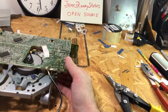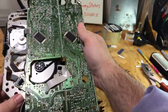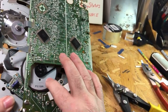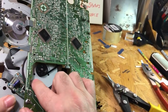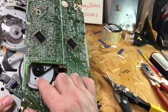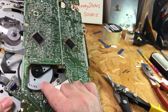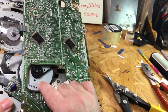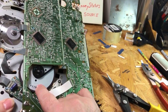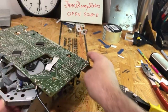Oh boy, here's the fun part right here. Look at this. For somebody who's trying to create something for some experiment with making a motor drive another motor, here's a really big flywheel with a pulley on it. If I was to interpose this between the two motors, I probably could change the ratio enough so the smaller motor makes this spin really fast. That'll make the bigger motor move even faster, and that bigger motor will put out more current, which will feed the smaller motor again. So, I don't know, we'll see.